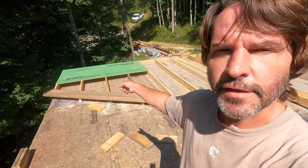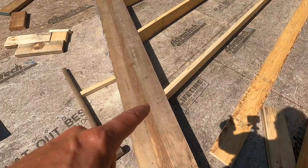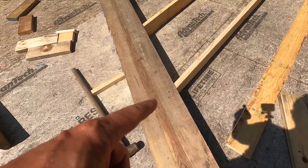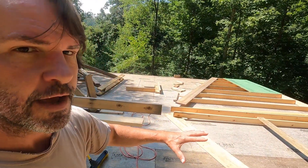So back to the barn build. As you can see, I have this half of the wall all framed up. That piece of sheathing is not actually tacked into place yet — I just wanted to look at the factory corners and edges to see if I was square. I'm having a little difficulty here because I'm off by about two-thirds of an inch in quote-unquote square, even though my far corner over here is square. I have to figure that out, but part of figuring it out is building the other half of the wall, which has got to be framed in with some windows. Once I get everything tacked into place, I'll be able to confirm that the entire wall is square. I think somewhere my math is off just a hair, but I don't think it's the wall — I think it's the building.